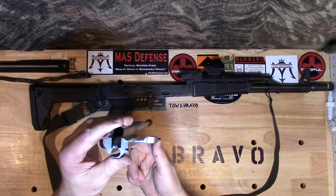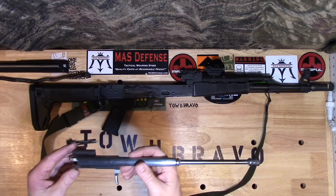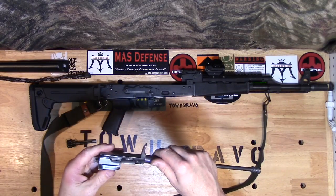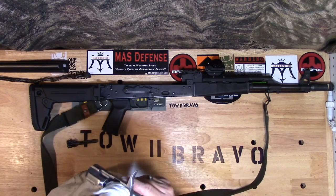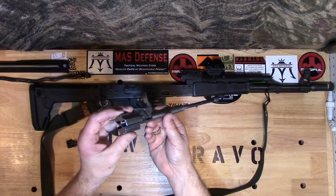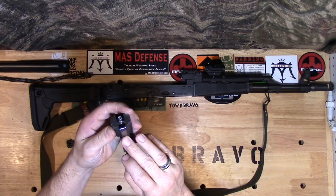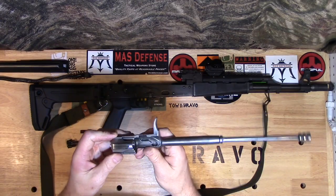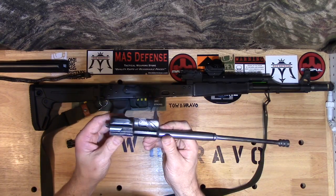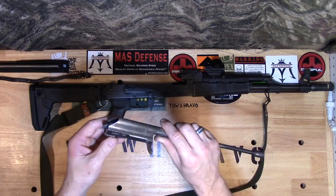In addition to taking care of all the edges on here, I did also file down the spine of the hammer on the trigger, being that I think that's pretty much been identified as the culprit leading to a lot of the mushrooming on this bolt carrier. As I quickly look at the rest of the bolt carrier, I don't see anything else that really jumps out as something that might be an issue. The rear of the bolt carrier looks good — I'm not seeing any deformed parts or mushrooming. Front end, everything is still smooth. All the metal looks good. It looks really solid besides the mushrooming, which I think comes back to the Tapco trigger. But the rest of the bolt carrier looks very good.